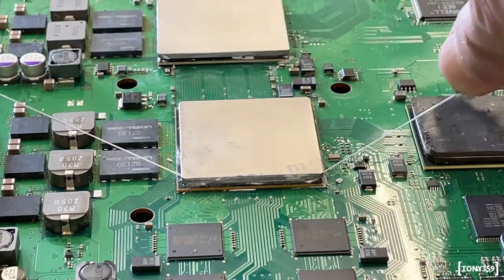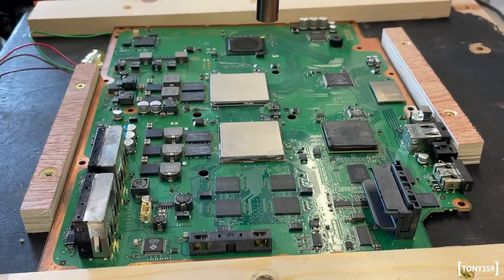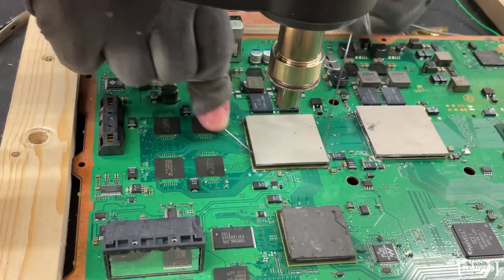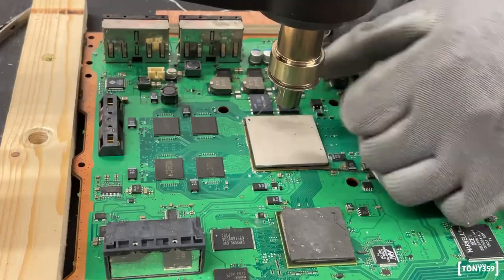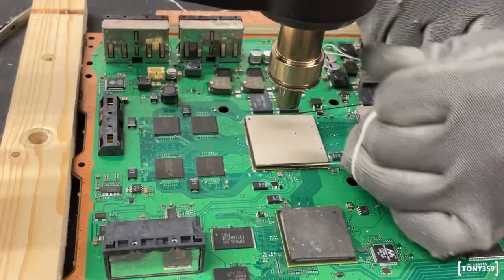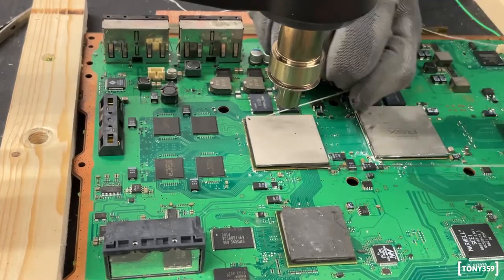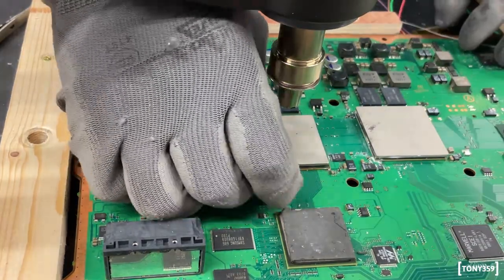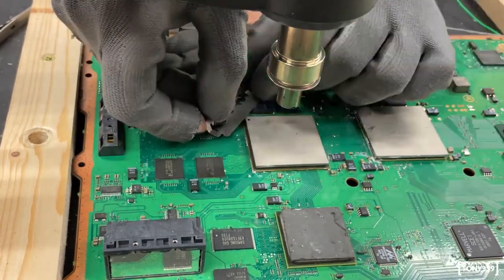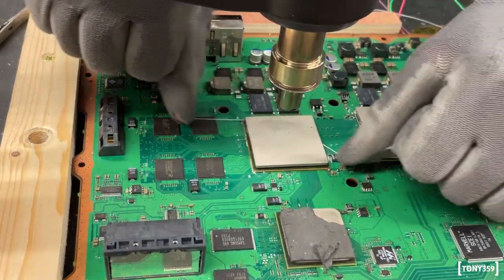Cutting the sealant with the floss line was extremely slow, tedious, and painful - I almost got my fingers bleeding. I used a ton of floss line, but as an upside my workshop now smells like a dentist surgery. The line kept breaking very easily, so I tried different brands and bundled two and three lines together. Towards the end I felt brave enough to use a very thin and flexible razor blade, and honestly I feel I should have used that from the beginning - thanks to the grooves already dug by the floss line, it went in very easily. Eventually I managed to cut through the sealant and the IHS was removed.